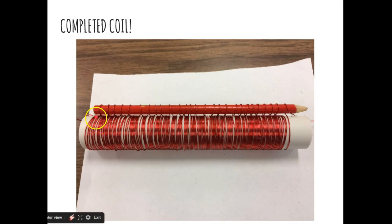This is what your completed coil should look like. Here's the pencil slid through there — we have a coil wire that's not overlapping anywhere, or overlapping very little. We are wrapping it five times and making a loop, wrapping five times and making a loop, until you run out of tube. Generally that ends up being about 120 to 150 turns. The reason we do this is that electrons are going to be moving in and out of this tube, and depending on where we clip our antenna onto these loops, we can get different stations — this is basically our tuner, letting us adjust to different frequencies.